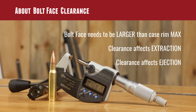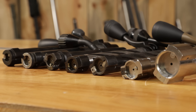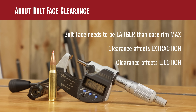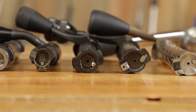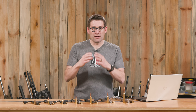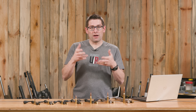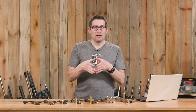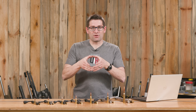About bolt face clearance: the bolt face does need to be larger in diameter compared to the case rim for which it will accept ammunition, and that is a tolerance. It could squeak by if they're approximately the same size, but you're going to want a tolerance there. You can actually have a bolt face of quite a bit larger diameter than the case rim, except you need good extraction claw engagement on your case rim. The bolt face does not contribute to supporting the case. That part of the case — the web and the rim — is so strong we don't need to squeeze it in from the circumferential perimeter.